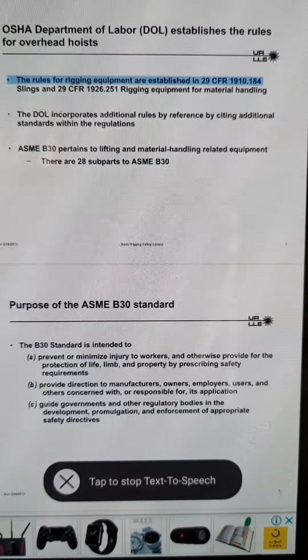Avoided whenever possible: 7/16 minus 14, 2500. If an angular lift is required, a properly seated shoulder pattern eye bolt must be used. 1/2 minus 13, 2600, 650. 9/16 minus 12, 3200, 750. 5/8 minus 11, 4000, 1000. 3/4 minus 10, 6000, 1500. Loads should always be applied to eye bolts in the plane of the eye, not at an angle to this plane. 7/8 minus 9, 7000, 1750. 1 minus 8, 9000, 2250.